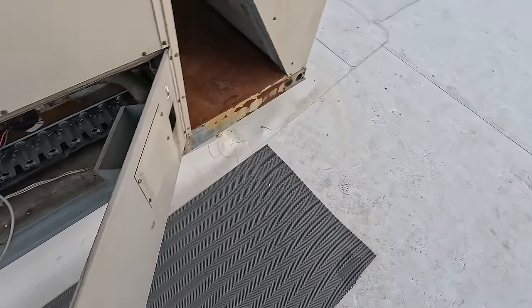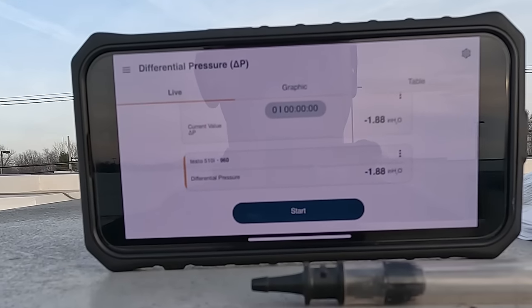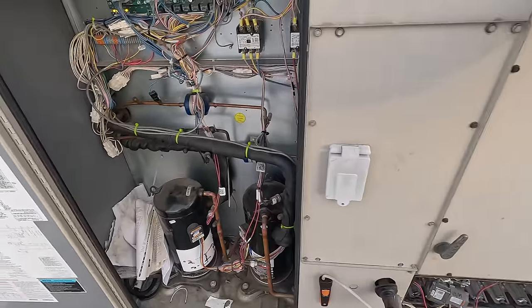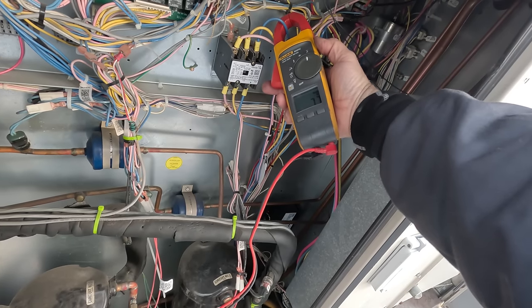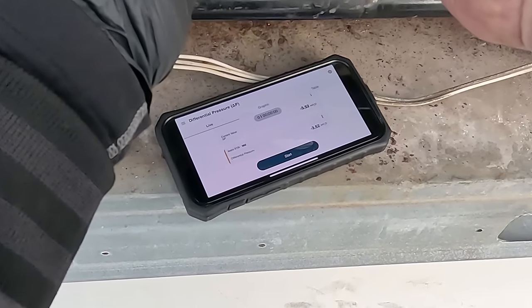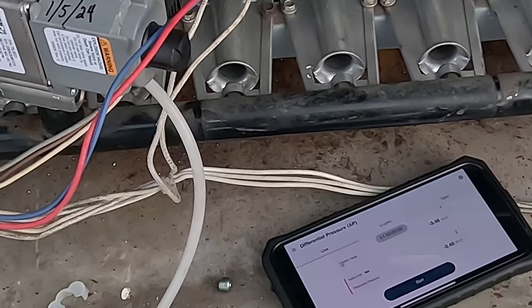Remember what I said — 6.2? Now we're at 6.7, 7.7. Well, ain't that some bull crap. No wonder why the poor little motor was getting hot — 7.7 amps, no wonder it was so flipping warm. We're shooting in at 3.9 inches of water column; that could be a problem, so we better drop that down just a little bit. Down to 3.4, 3.3 — leave that there. So the high fire does fire. Let's see if we can get this fan blade speed fixed.